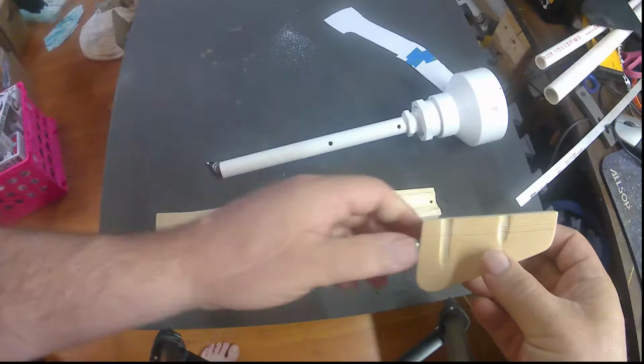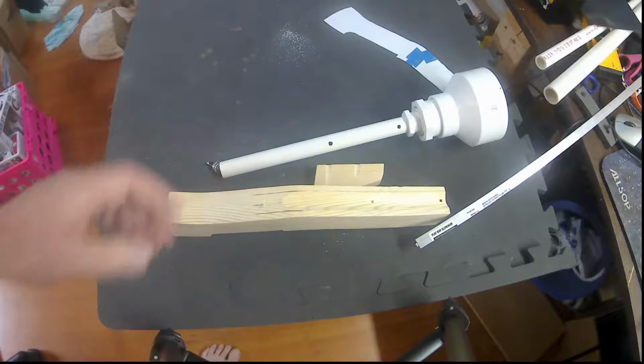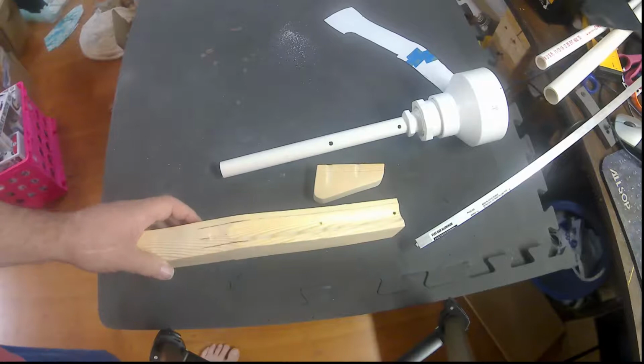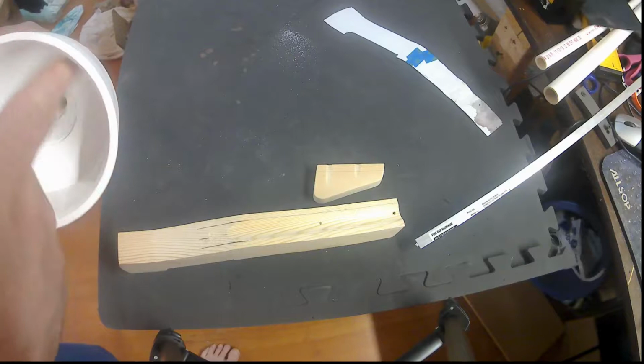Now I've got to take the aluminum and make the trigger guard to go right here. One thing we're doing different from what was on the Happy Trooper's website is we're going to install LEDs. I have a small momentary switch, so instead of using the trigger as he described, this will be mounted up into the wood here, with the wire going through the wood, coming out into the barrel, to the end, where we'll have several LEDs. Probably put the battery in there too, a 9-volt battery. Make an insert that'll go in here, and mount, say, three LEDs in it.